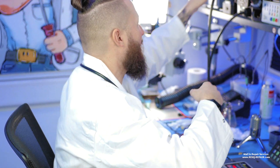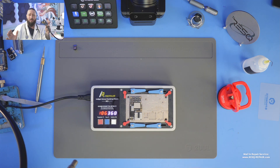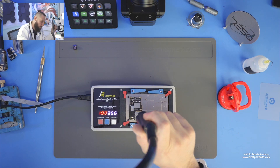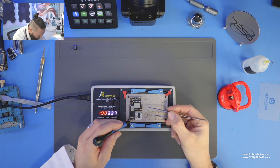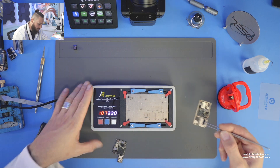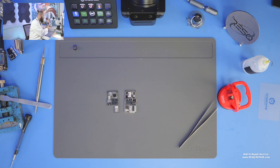I think I know what's about this board. To all the people who say why you use such a nice preheater and also use hot air — it's only to speed up the process. This preheater is incredibly fast. It has a huge preheating element, not like all the other preheaters. It's the biggest one on the market at the moment, and it heats up really fast with a stable temperature. But I want to be fast, so don't risk any cold solder joints between the board halves. After that, we just need something to hold and something to lift up.